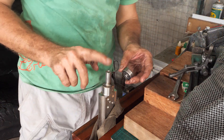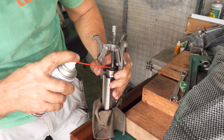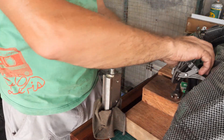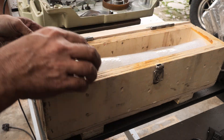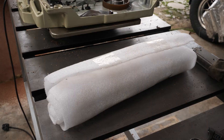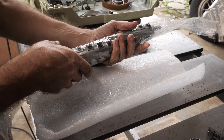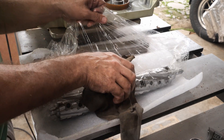I'm going to lubricate it. One bearing is out — this was the easy one because the shaft is longer — and it's in perfect shape. I'm on the second bearing with the short shaft, using lithium grease. The second bearing is off, also in perfect shape. Time to open the new head — it came in a nice plywood box. Here it is: we have four rows of 12 carbide indexable blades. The blades are made in Germany and are very sharp.